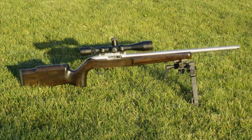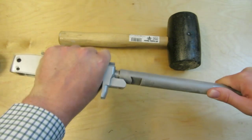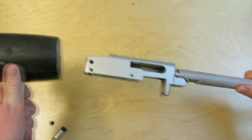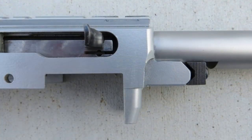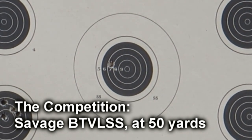To wrap it up — visually, this custom build rifle looks very nice. The stock finishing, which I brought on myself, was kind of unpleasant, and I'm not really happy with the way the barreled action fits into the barrel channel of the stock. We'll see if that's a problem as we go out and accuracy test it. The barrel installed relatively easily — I've got a video of that on my channel. It took me a couple of tries to get the extractor timed, because I really wanted to believe that using a level would work, which is how Kidd described it in his instructions, but I found that to just not be the case.